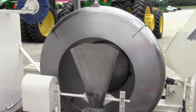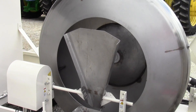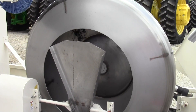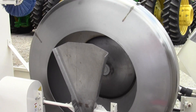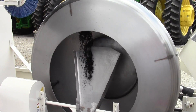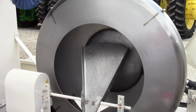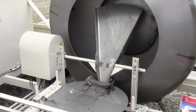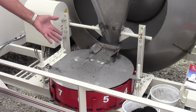As you're raising the drum, there's a 12-volt motor. You're taking a gauge and continue to mix the sample to get a homogenous, well-represented sample. Once it's mixed, bring a funnel in, and when you bring the funnel, it opens up the tray. Soil flows into a container, and when the drum's empty, bring the funnel back out, it closes the top, and the tray rotates to the next position.